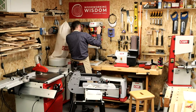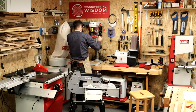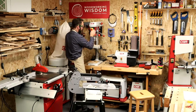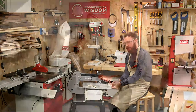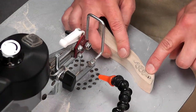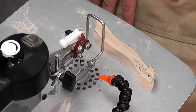I'm using that lip and spur type drill bit again — a really nice thin one, about 3mm. It's supported underneath so we don't get any breakout on the underside, giving us a nice clean exit. That's really important — it's not going to rock on those kind of broken out fibres.